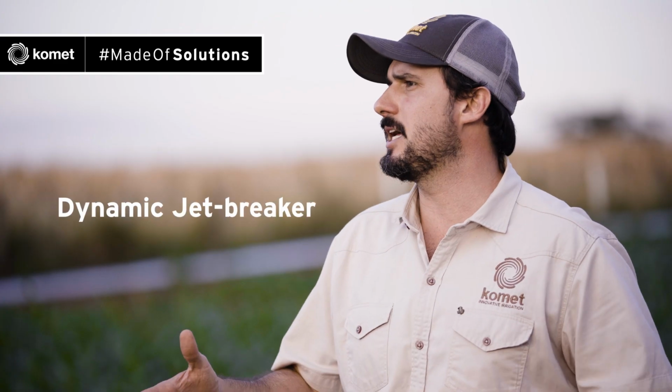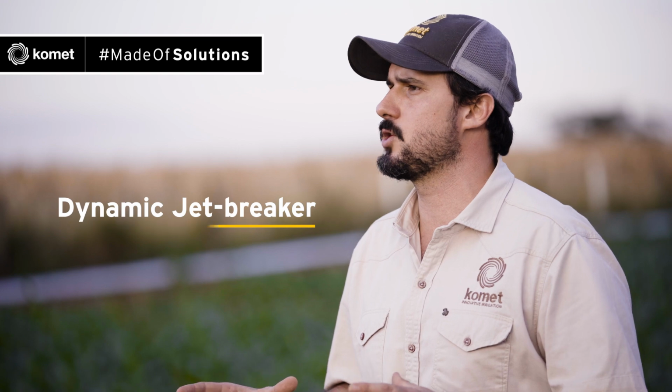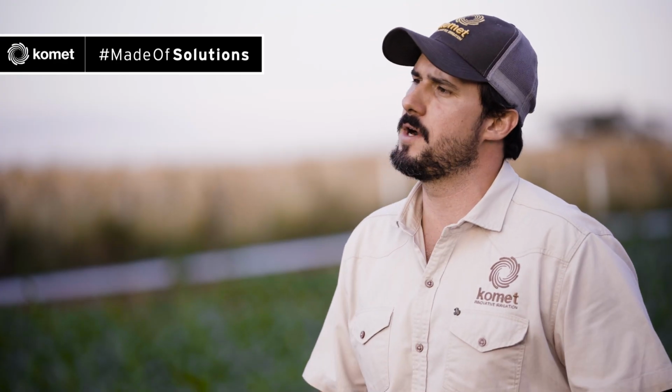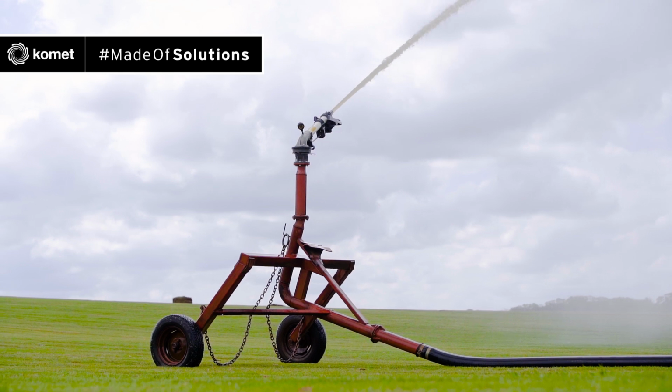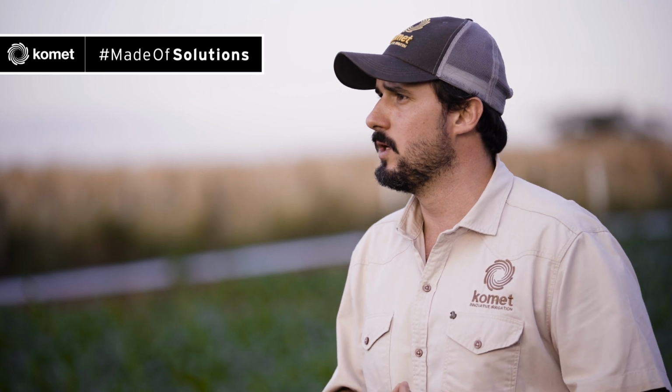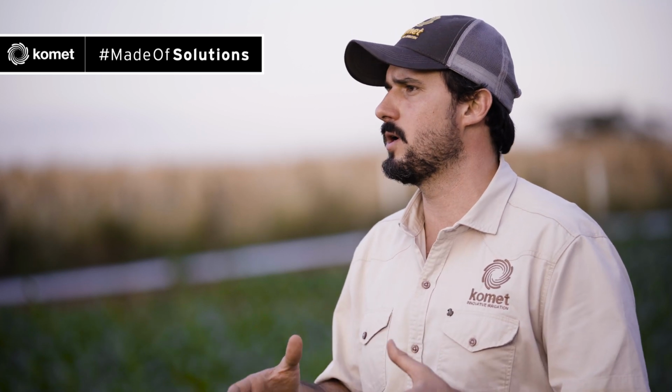The dynamic jet breaker allows to redistribute parts of the excessive water from the end of the throw back towards the gun. This is typically the case in lower pressure conditions or if more water is required near the machine. Another important advantage of this device is that it allows to adapt the water distribution profile to suit the requirements of solid set systems.